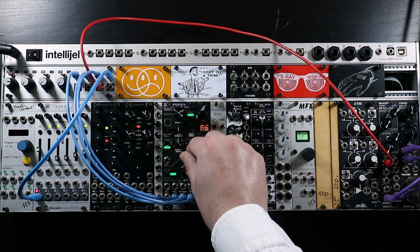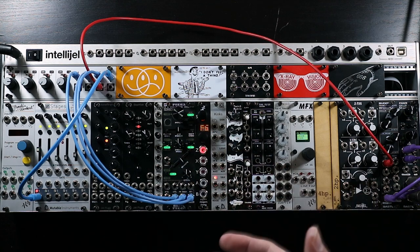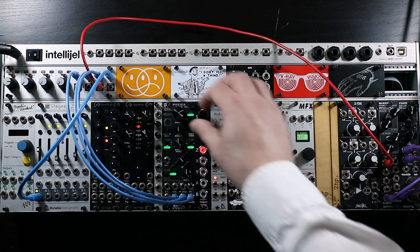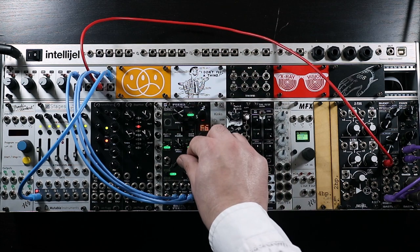You can hear there, that's a digital multi-stage folder, and what we're getting is a much cleaner walk through the harmonics. So a very different kind of feel there. And of course, if we are FMing our carrier first, we're going to be FMing it and then wavefolding it, which is going to give us, again, more intense results.